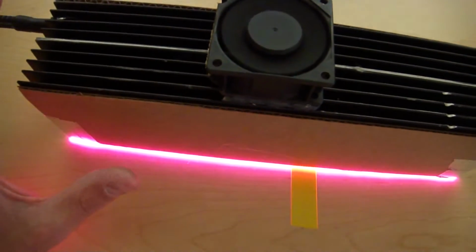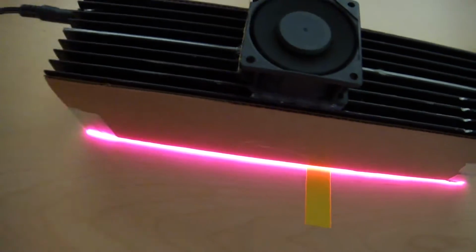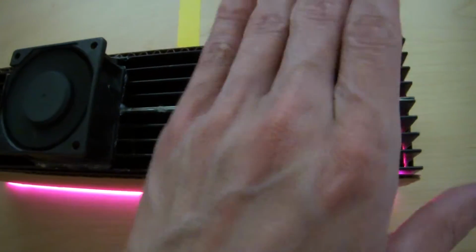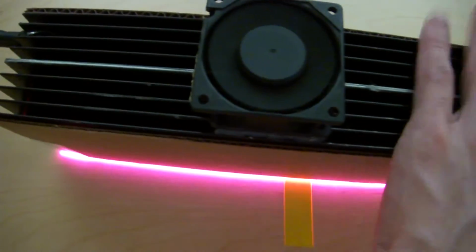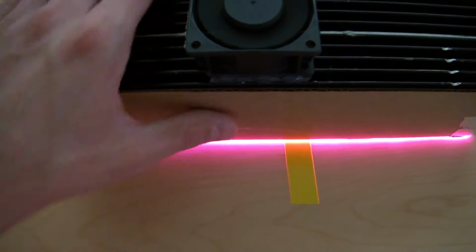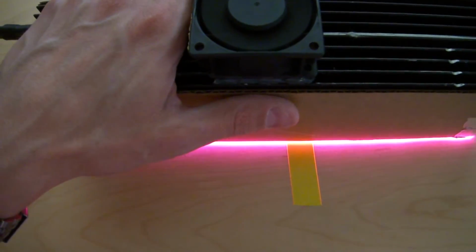We're secretive about our products so people don't just run with stuff and mistake information. But as you can tell, this is made with cardboard reflectors and a fan here to keep it cool, and even with this fan and the 25 watts, this heat sinking far exceeds manufacturer specifications for these LEDs. However, this can get warm. We've run this exact design for almost 1,000 hours, I want to say.